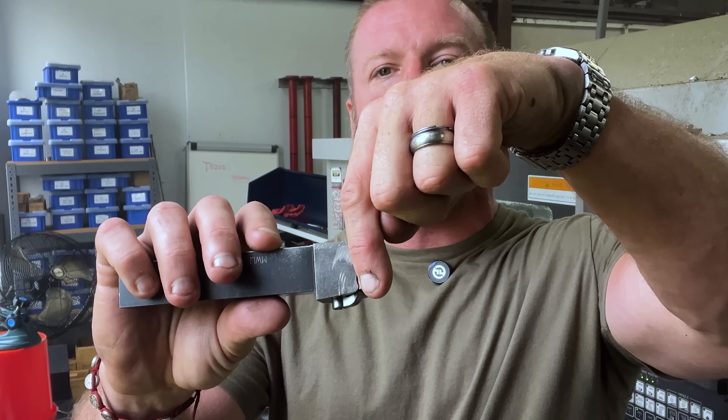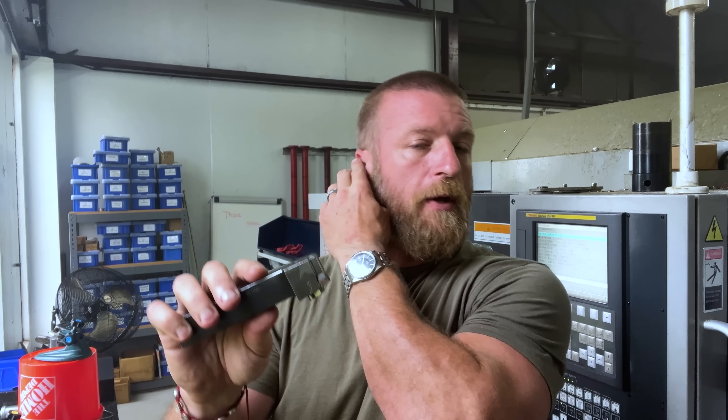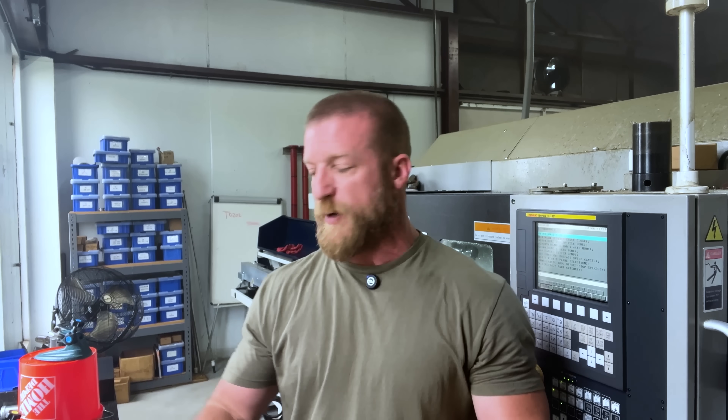If you're aiming it down here, that's not horrible — you're getting it. But I like to aim right underneath. The idea is you want to try to get the coolant between your insert and your workpiece.